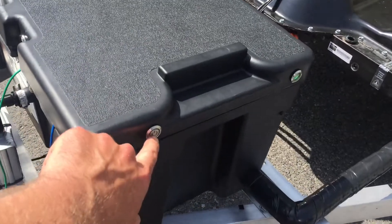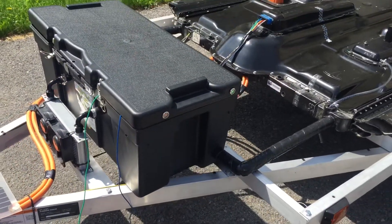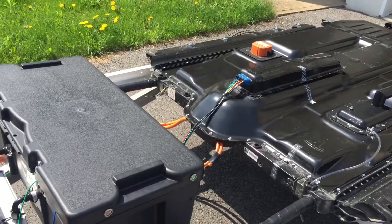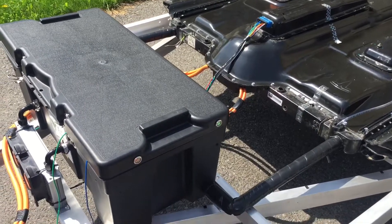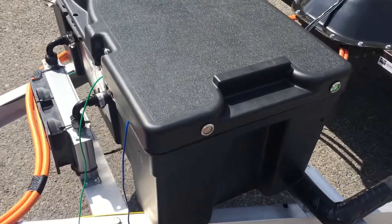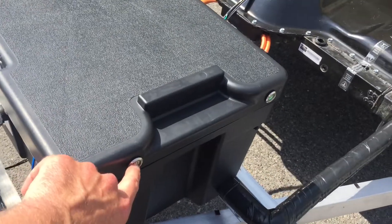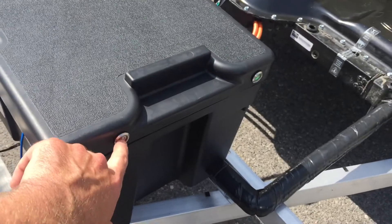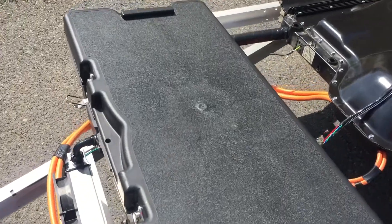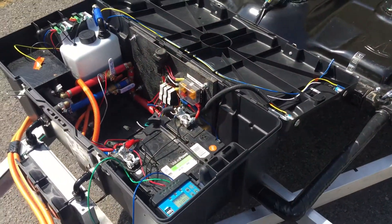So I'm not going to make the same mistake. If I push this button — you can't really see it in the light — the red indicates that the contactors are active. They're not active right now because the wire isn't connected, otherwise it would just heat up and bad things would happen. Normally I would leave that button in, and anytime I want to disconnect the contactors while leaving the rest of the pack on, I just hit that button — it kills the contactors but leaves all of the temperature management system working.